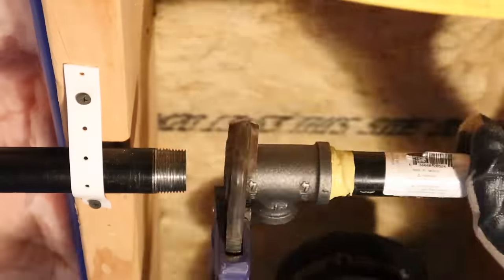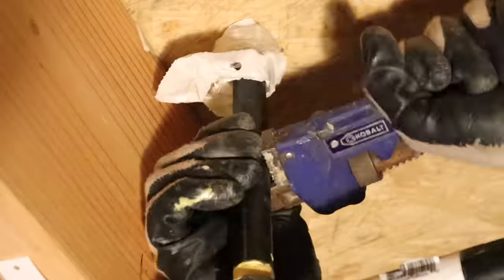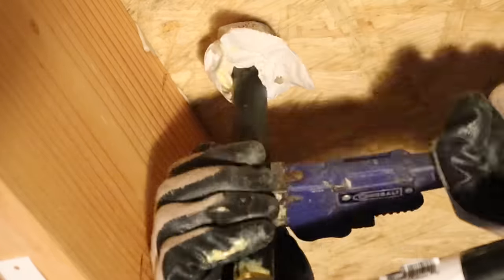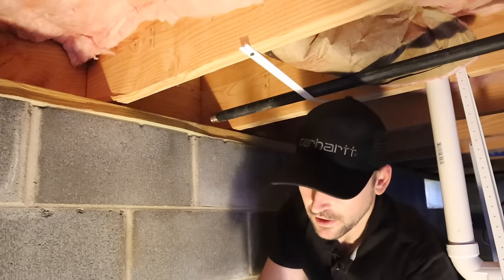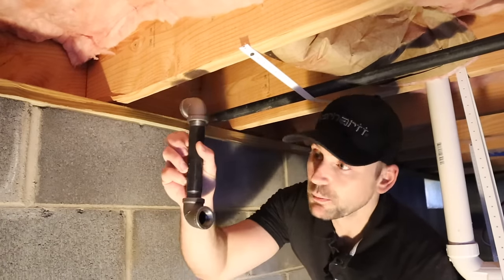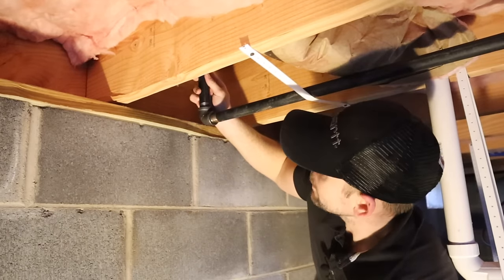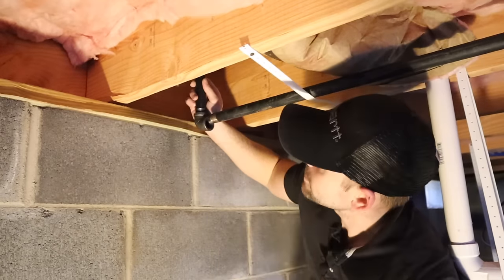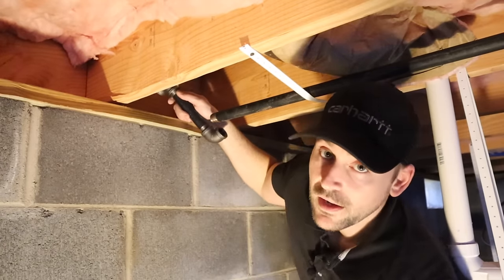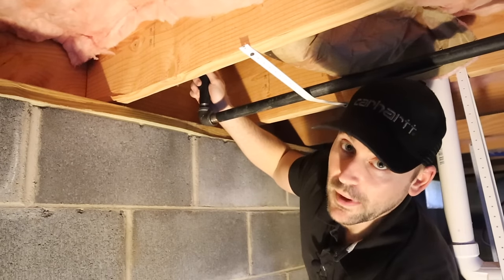This is a reducing T. I'm going to be stubbing up to the gas range right here, so I turn the T until it's tight and make the final twist to angle it up to where it needs to be for the range. At the end of the run before it exits the house, I dry-fit elbows on a six inch nipple, hold it into place to see where it puts me, since I need to take a 12-inch piece out through the house to give me a place to hook onto the propane tanks outside. I take measurements and then drill out the band board.